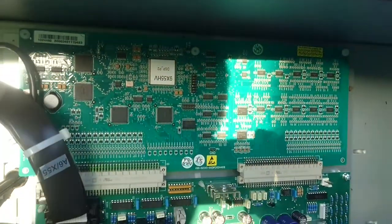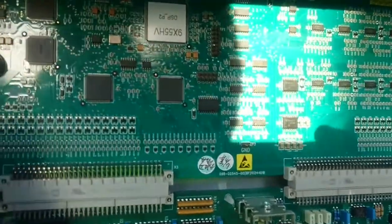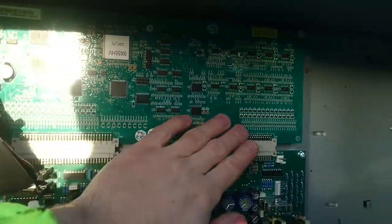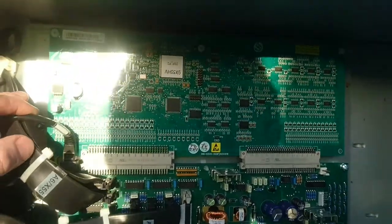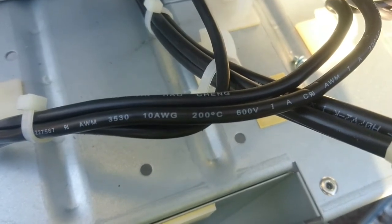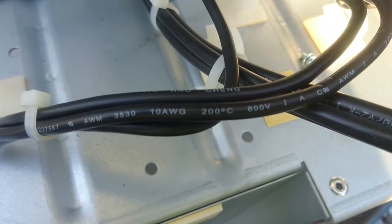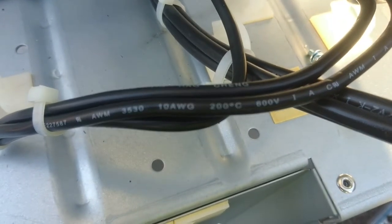Up at the top we have the central processing unit. There is a sticker above the CPU, but it seems to have four analog to digital converters. It has a lot of input pins — it's doing a lot of measurements, all kinds of analog analysis of how well all the voltages and currents are behaving in this UPS. A peculiar thing I have not seen in an inverter before is a 200 degree Celsius rated wire going to the inverters themselves. It seems like a regular 90 degree Celsius wire isn't enough anymore, which is kind of worrying when you think about the amount of heat produced.